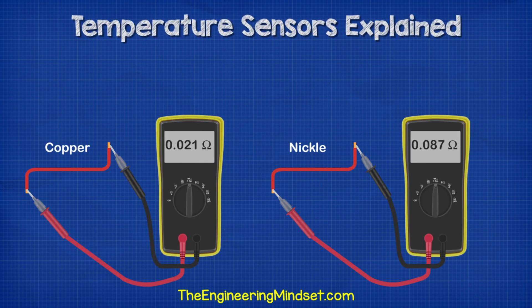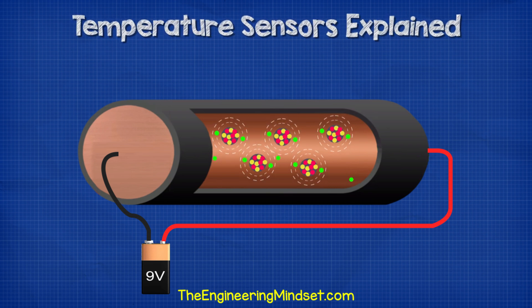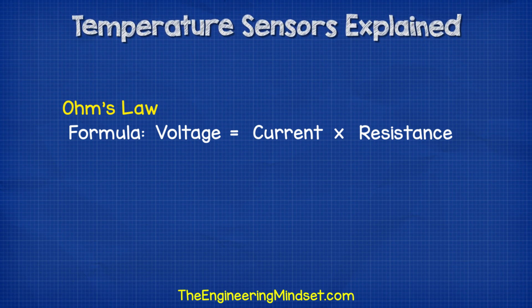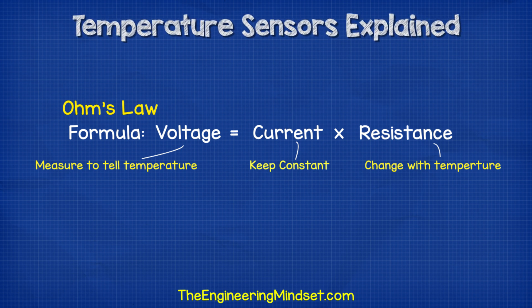The temperature of the material will change its resistance. Most conductors will increase in resistance the hotter they get — that's very typical of metals. This occurs because as the atoms and molecules become excited, they move around a lot, so it's harder for the free electrons to get through without a collision. So using Ohm's Law — voltage equals current multiplied by resistance — as long as we keep the current the same, a change in resistance will cause a change in voltage. And as temperature changes the resistance of the material, we can measure the voltage to tell the temperature.